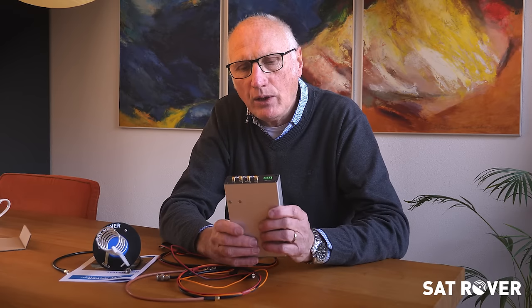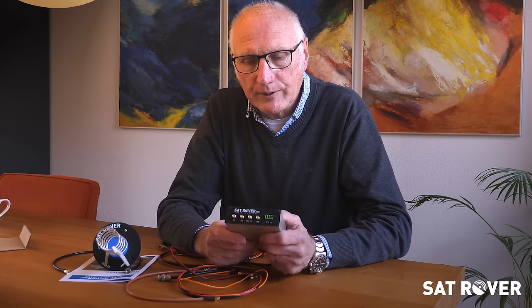I'm going to show you how we connect it together, how the setup is. I use a very small dish, a 60 centimeter dish. So that's on the low end for signal strength over the satellite with the 4 watts. And also on reception, what I said, a 90 centimeter dish works the best on the unit.